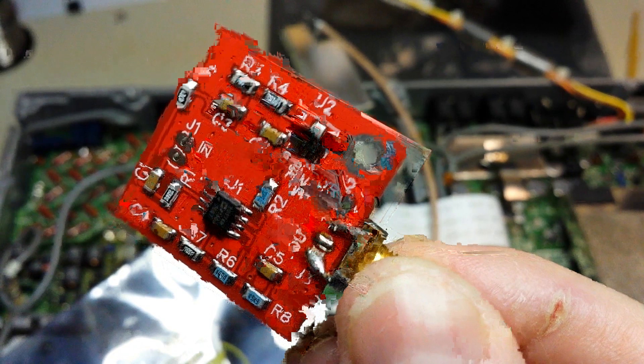It's angled a bit and doesn't look super pretty, but it works. Just make sure that where it sits near C11 — even though C11 isn't in place right now — your shielding or ground doesn't hit that point, because it can get pretty close. Radio Shack sells an SMA connector similar to what I used that's a little smaller and fits quite well.